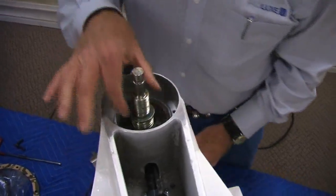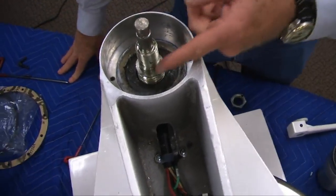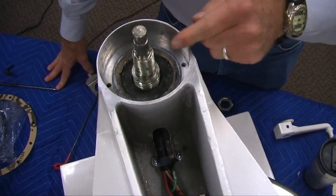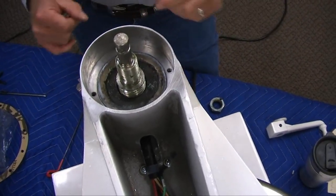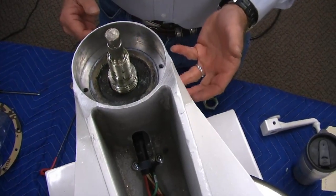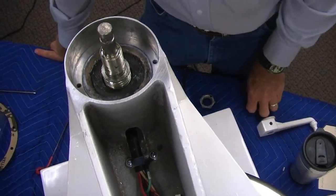You'll see down below another nut, a flat surface there. And you can see these threads are for the crank turning. When it's locked together, it's going to turn this thread action down below. In the post, there's a welded big nut in there. And it's actually threading this down by the thin, threading it up by the thick. And so, like I said, it's only this much of a turn, which turns it from minimum to maximum.